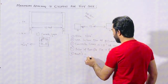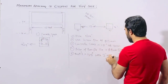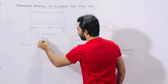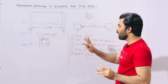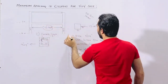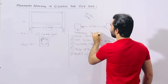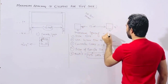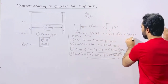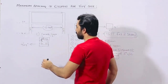Hooks should be bent at 135 degrees with 3 inches or 75 millimeters. The maximum column spacing should not be more than 15 feet — this is the maximum spacing for G plus 1 story, 2-storey construction. These are the steel reinforcement details.